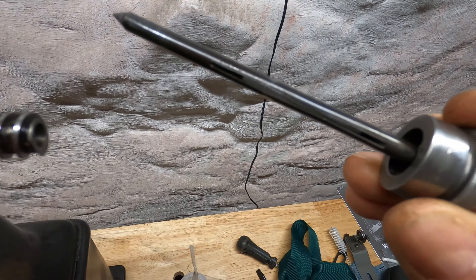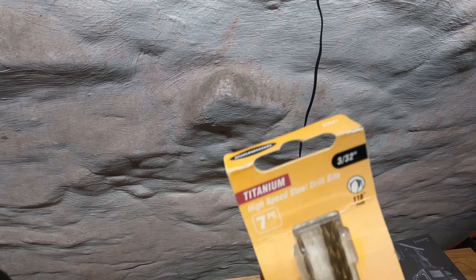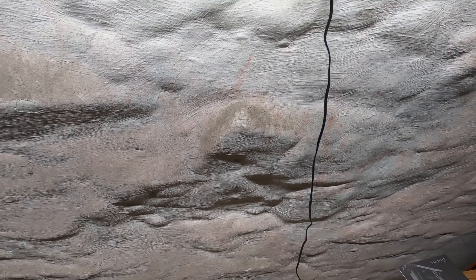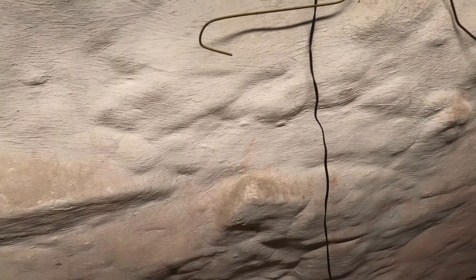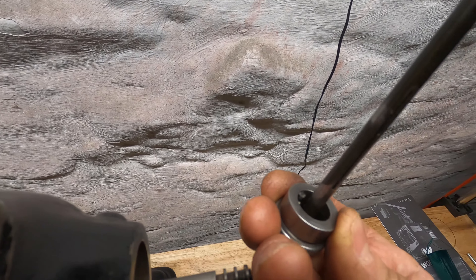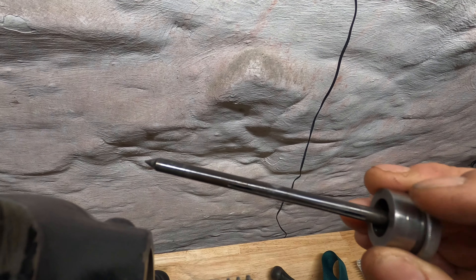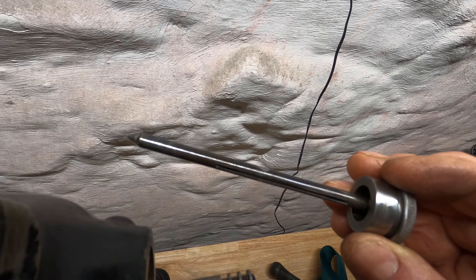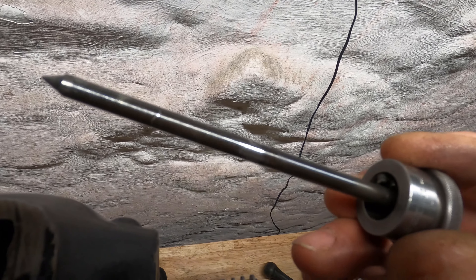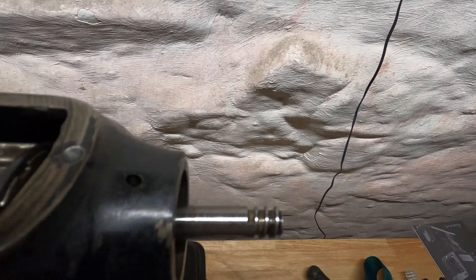So what I did was I drilled the hole with that drill bit I showed you before. Here's the drill package — it is 3 thirty-seconds. And that piece of coat hanger wire — there it is right there. A piece of that, I flattened the end off nice and rounded it up. It fit kind of loose, so I hammered it flat — I actually squared it up — then tapped it in, ground it off, and filed it. There are a couple of marks on here from the clamp. Oh well — it saved the machine though.